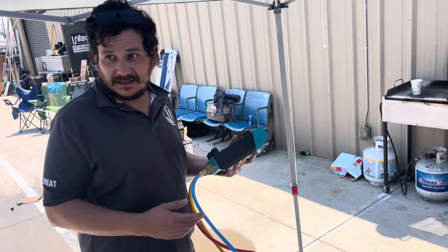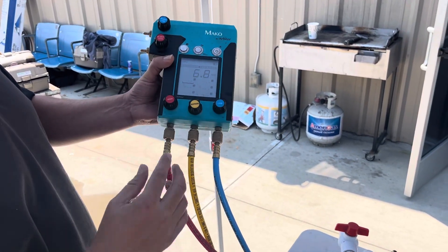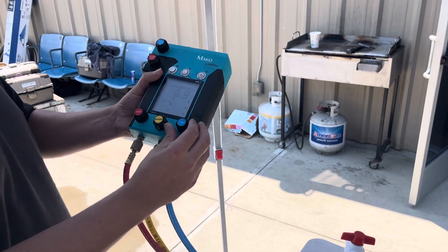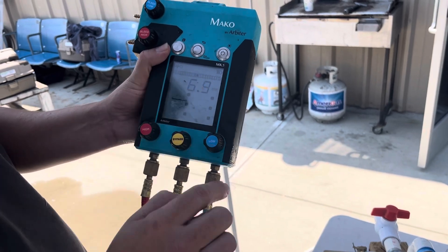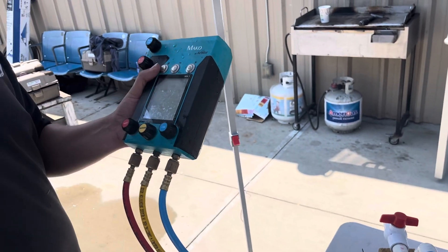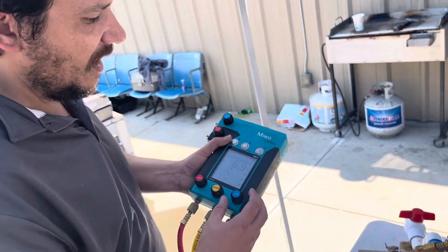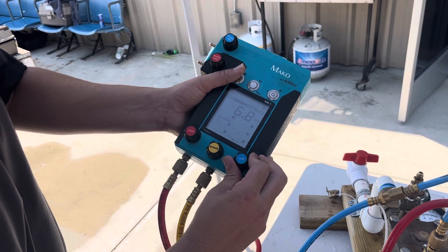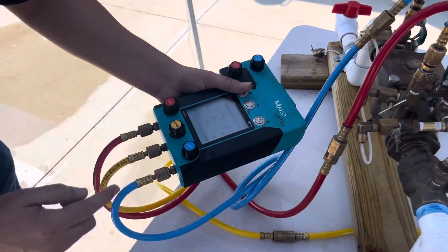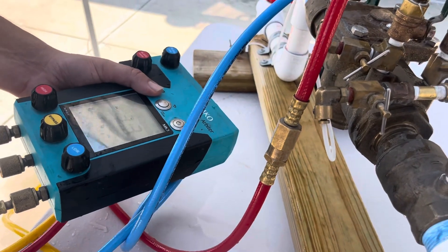So we're going to do the mix. To mix, we open the high control one full turn to let the high pressure into the manifold. We crack the low — going very slow, only getting a few arrows so I'm not reducing the differential too fast. We mix these together and record when the relief valve opens. We give a little crack and check — not too many there. Now I'm going to watch this and when it comes, I'll push the button. There we go.